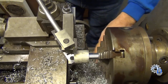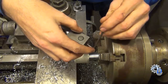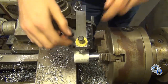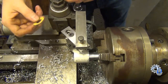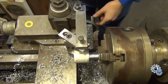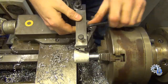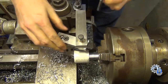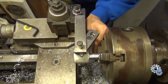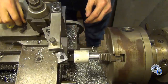Now I need to adjust the clearance to the chuck jaws and set the radius of the cutter, so I have to disassemble this slightly. The top handle comes off, which exposes the thrust washer — and this thrust washer is nothing more than a piece of polyethylene off a yellow milk jug. Poor man's Teflon, they call it. Once I do that, I can come in with a wrench to loosen the top of the tool post and loosen the bottom one slightly. Once the clearance is set, I go ahead and tighten the tool post back up.